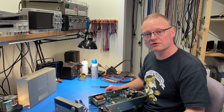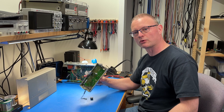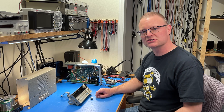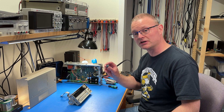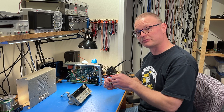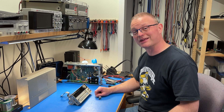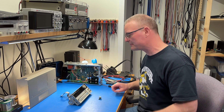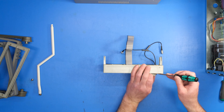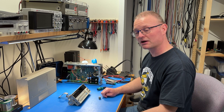And now I'll tighten up the transformer. With the front panel removed, I need to get the knob off the encoder so I can remove the circuit board that's on the back. I bet that knob is just pressed on — the replacement encoder has a D-shaped shaft, and the two ways of attaching to a D-shaped shaft is either a press fit or a set screw. I don't see a set screw anywhere on this knob, so I bet it's just a press fit. I'm going to gently work behind it with a flat blade screwdriver and maneuver it — it's already loosening. And I was able to do that without scratching the front panel, so life is good.